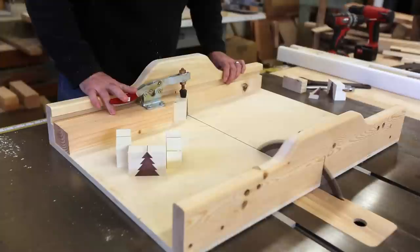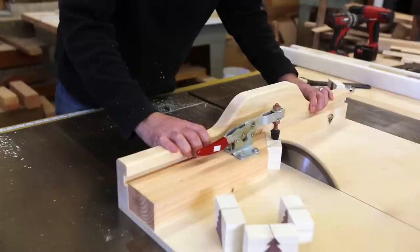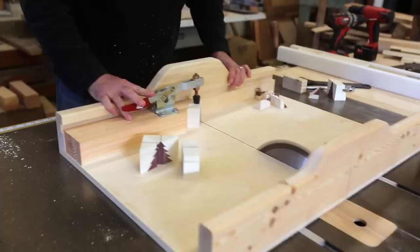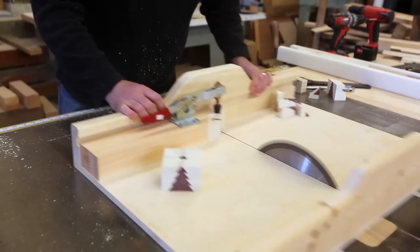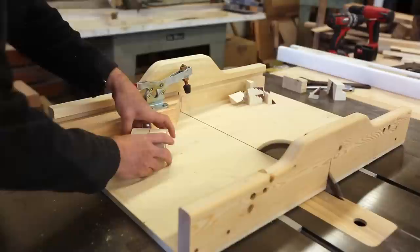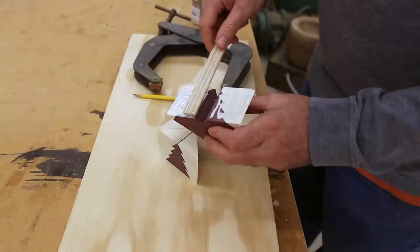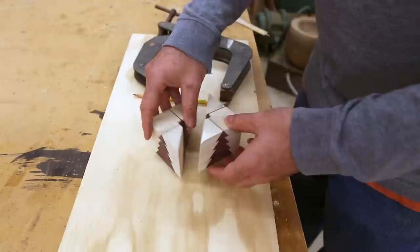Here I'll mark the angles I want to cut. If I'm going to make this a four-sided piece, I need to have a 45 degree miter on each side. So I made a jig that fits within my sled that holds the little piece at a 45 degree angle so my fingers aren't getting too close to the blade — and it worked really well. They fit together nicely. I couldn't figure out how I was going to clamp these because they're at a 45 degree angle, so I just glued them and held them with my hands until they were set up, which really wasn't very long — maybe five or ten minutes. I sanded each half so that they fit together, so my miter doesn't have to be absolutely perfect. I can sand out the difference when gluing the two halves together.